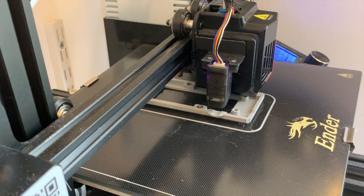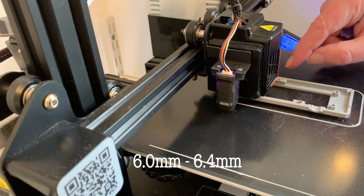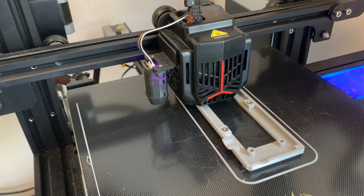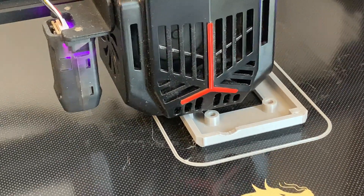It's actually not as dramatic as it appears here, and with two layers of leeway I've got plenty of time to line up the next one, pop it in and press it flat so the print head doesn't hit it when it goes over. Then at layer 33 we start to cover it over.